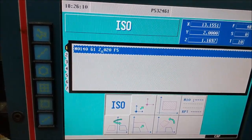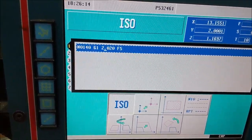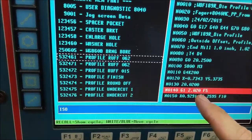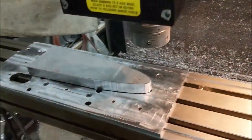That way we can trace it out and compare to the witness line to make sure the first tool is cutting where I expect it to. I'll drop that in the program and replace it — and I can see it's replaced with point zero two. I need to pop the tool in quick, I didn't put the tool in.